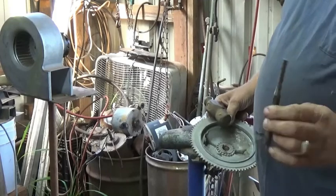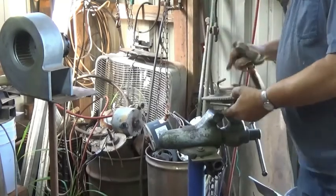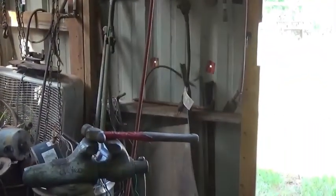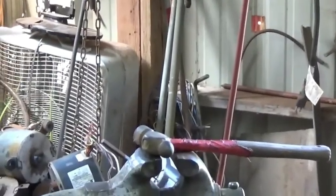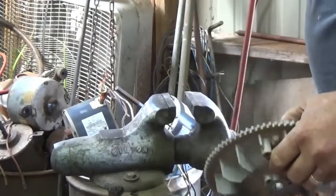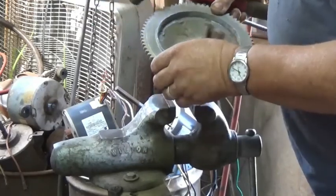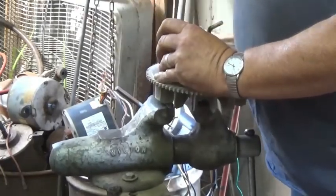Basically take a good sized pin punch, that's probably a good quarter inch or so. Now we'll go with the counterweight first. I think I'll go ahead and try to zoom in a little better. Move the tripod a little bit closer. Loosen everything up, might turn a little, move a little bit easier. I want to do this on the vise, that way everything has somewhere to go as I try to punch it through. So right here we go to the opposite, and the first couple I did on this I drilled it out. Drilled the hole down through the metal, but then I found out later I didn't really have to.